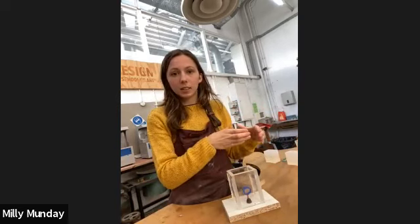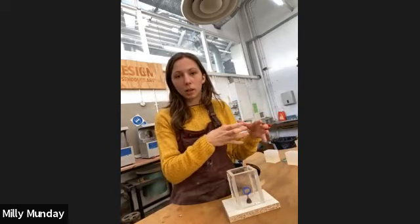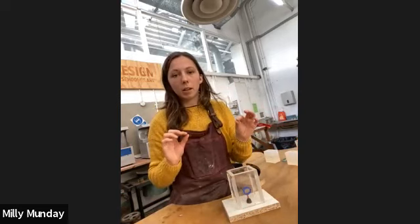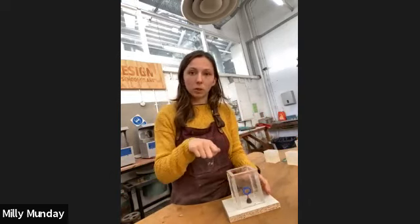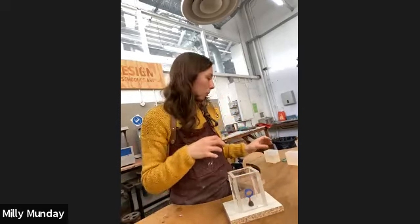Then what we would do with that mix is we would go and degas it. So putting that in a vacuum chamber to get all of the air out, so that we can make sure that the silicone mold was as smooth as we could get it. Once we've done that, then we would just pour it into our pre-made mold and just leave it on the side to set. Again, each different type of silicone will have a different cure time, but in general, we would leave it for 24 hours, overnight, and the next day we would have our mold